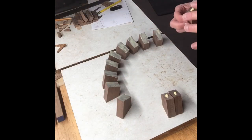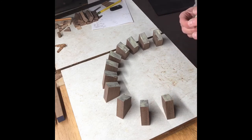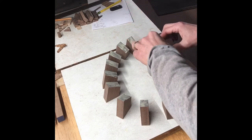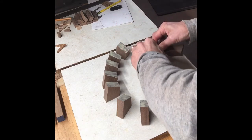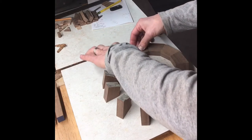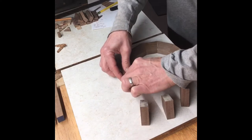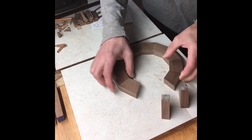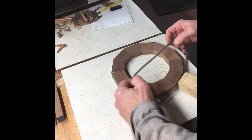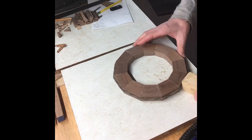After cutting those 12 segments, they are placed in a circle just to make sure that it aligns perfectly with no gaps. Then I like to stand the segments on end, apply a little glue on each one, and piece it together. My personal preference is to use the tourniquet style clamping — I have a screwdriver just outside the picture that I use to tighten the noose around all the segments. This allows me to get very tight segments quite easily, and I can adjust the size of the loop between rings.